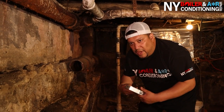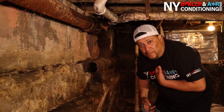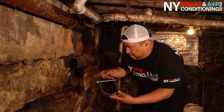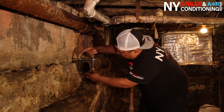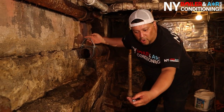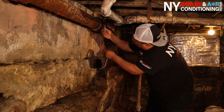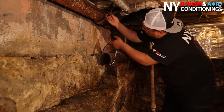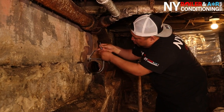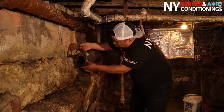I want to give you a little visual. As we're putting the pipe together going downstream, we have to support the pipe — about every five feet we're going to put a clevis hanger. This is what a clevis hanger looks like: this side goes into the wood beam and this side is a 3/8 rod. There's going to be a 3/8 rod from the beam down to the clevis hanger, with a washer and nut. As you adjust the nut, it goes higher and higher and supports the pipe.